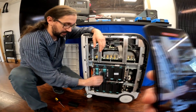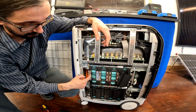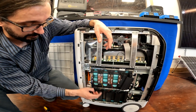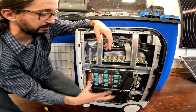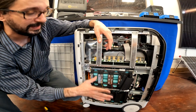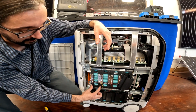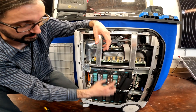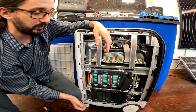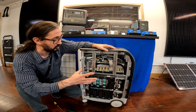If we pop a couple more of these out, we can see these bars here — I imagine they're connected to the batteries, pretty sure they're parallel plates. We've got sense wires coming off all of them, so it's monitoring the battery pack — able to see what each bank of cells is doing. Looking at the markings, each one of these is one module of cells, and then they put them in series with the next module. In any sort of series arrangement, you need monitoring between the cell banks — it's very very important.